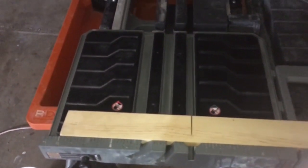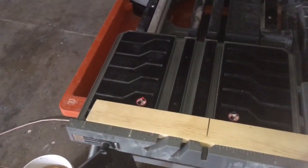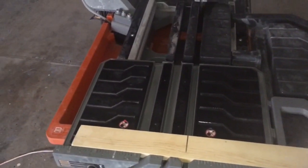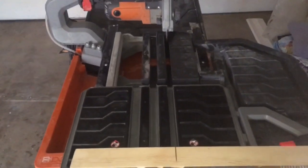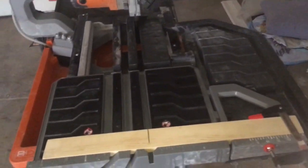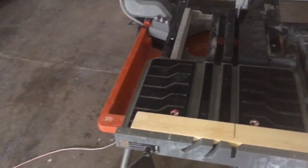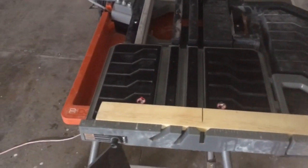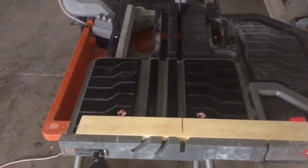This way, you can do rip cuts that are going to be visible — just like when I did the fireplace. There's not a lot of cuts getting buried on that, and a lot of the cuts are visible and need to be straight. The pieces need to be the same exact width as your previous piece, or sometimes you need a little adjustment. You need to feather something in — sometimes you may need to be an eighth smaller on one end. This will allow you to rip at a slight diagonal and hide things.